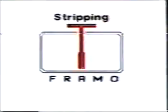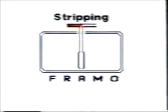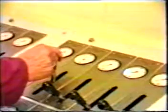Stripping. When the cargo tank is nearly empty, we are in the stripping condition. Reduce the pump speed when pump starts to cavitate or lose suction, indicated by vibrations and/or hydraulic pressure pulsations. Empty the tank at reduced pump speed, that is, reduced pump capacity. Throttling of cargo valve may improve the stripping results. When the cargo pump sucks air, close the cargo valve. Start stripping of the cargo pump by opening the stripping valve with air or inert gas connected.